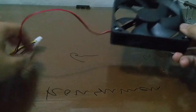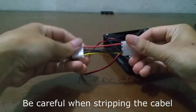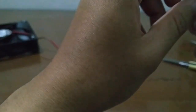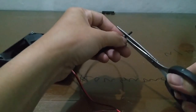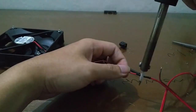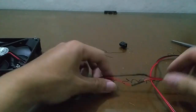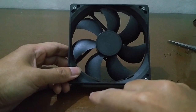Now we move to the fan. The fan has its own cable jack that does not fit the adapter I will use, so I replace it with a DC port and extend the cable. I use some heat shrink tube to cover the parts that I've soldered. Before you start soldering the cable to the DC socket, make sure the fan turns in the right direction. If the wind blows towards you, then you need to switch the cable placement.